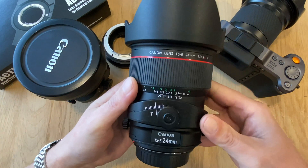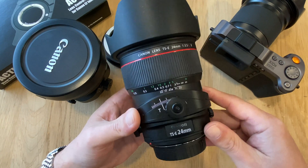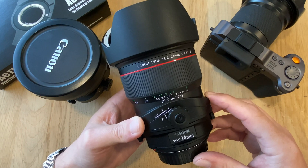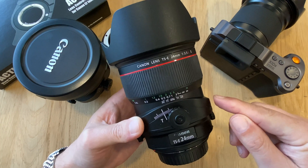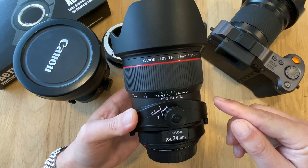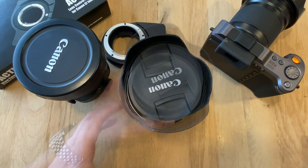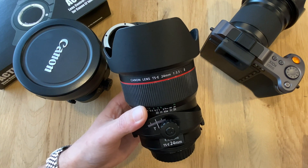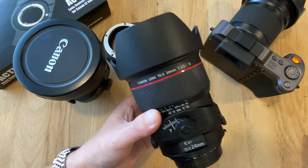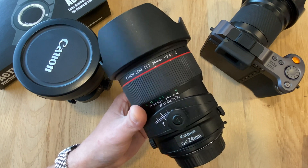You have no means to control the aperture on Canon EF lenses on the lens itself — it's electronically steered by the camera body. If you switch to a certain aperture on a Canon EF camera body and then dismount the lens, the aperture will be stuck at that last setting. For example, if you shoot at F8 and dismount the lens, the aperture is programmed to F8. You can also program the aperture using Canon R bodies like the R, RA, RP, or the new EOS R5.